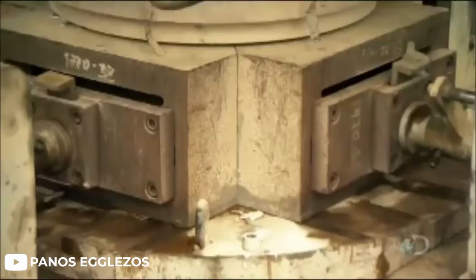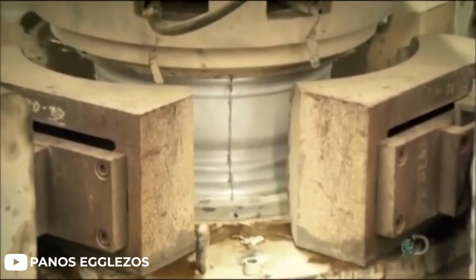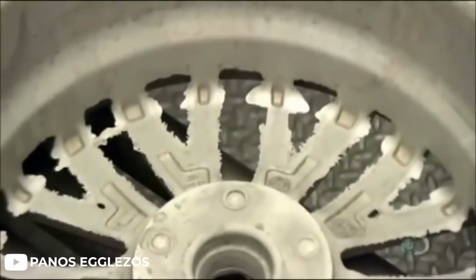When cast wheels or low pressure cast wheels are manufactured, the alloy is melted down to a molten metal and then poured into a mold like we said. This almost eliminates any uniformity in the grain structure of the metal. The metal can also become porous due to gas formations or solidification shrinkage while the molten metal cools. In turn, this can cause imperfections that can have effects in the performance of the wheel, can cause microfractures, and a whole bunch of stuff that you don't necessarily want.